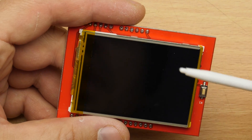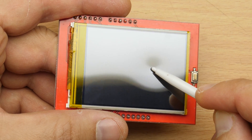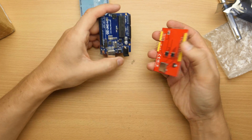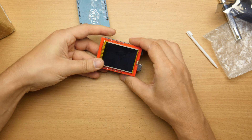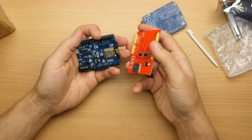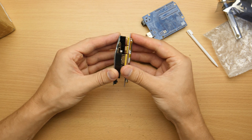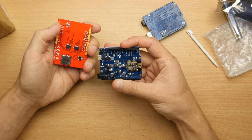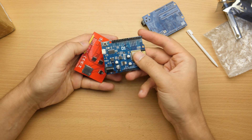It's resistive - you can see how it flexes with the stylus here. So it fits on Arduino Uno like this shield, and also on the Wemos D1. But this won't work because the ESP doesn't have that many data pins - we have at least eight data pins and some control pins.